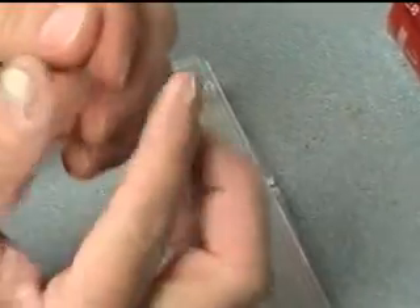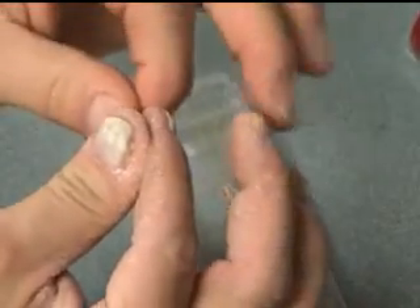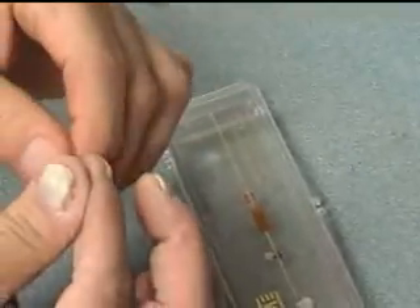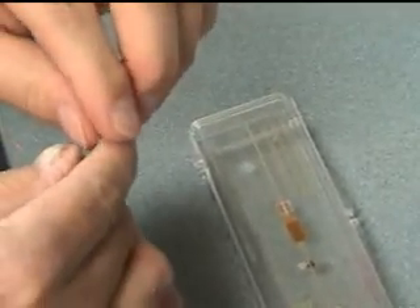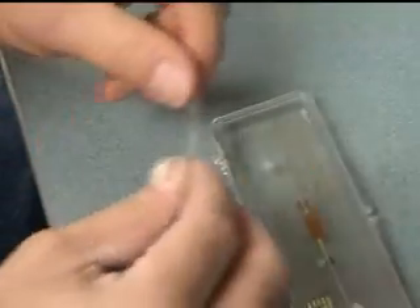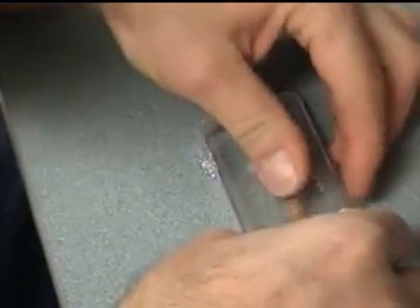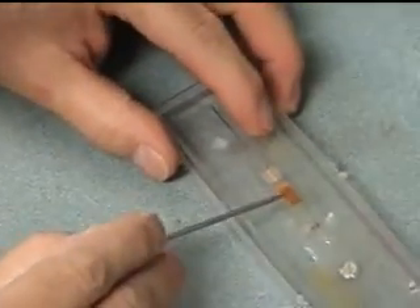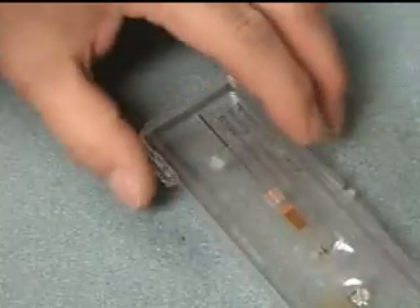Cleanliness is very important in strain gauges because there is a very small area that depends. You can attenuate the stickiness of the tape with your fingers — that way it reduces how hard it sticks to the gauge. You're basically only holding the gauge in position with the tape, and that's all that needs to be done. It doesn't need to be strong at all. As you can see, we have a gauge and a terminal strip. The terminal strip is very important as you'll see as we proceed.